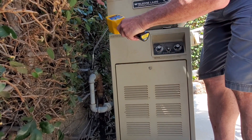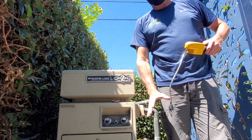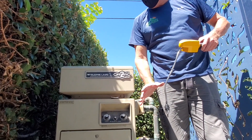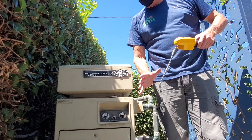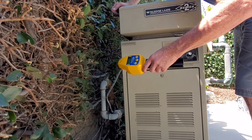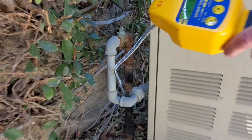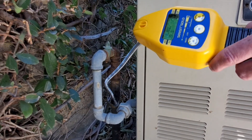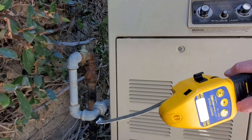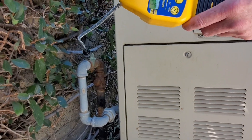We do have an issue — let me back this up. I'm airing it out, getting it over to more diluted air; that could have been a false reading. But we double-check — and yes, we have a gas leak over here at the union. It's telling me there's a potential gas leak and it sounds like it's coming up right at the top. We're at the bottom, so basically this union needs to be checked, and I think we had one over here too.